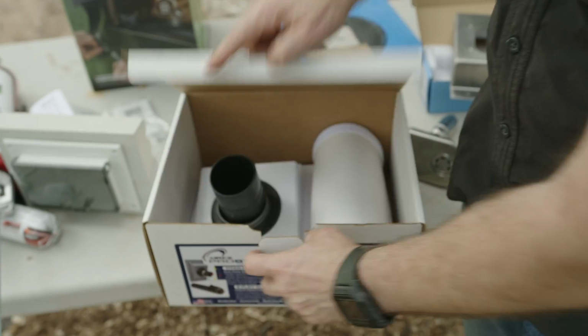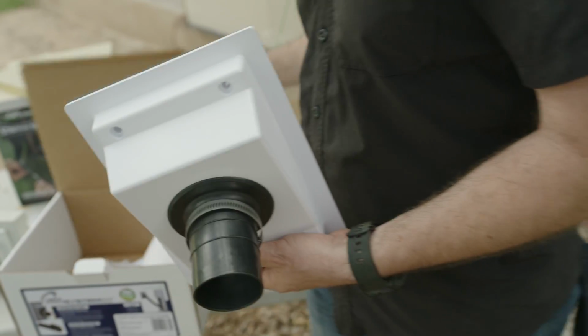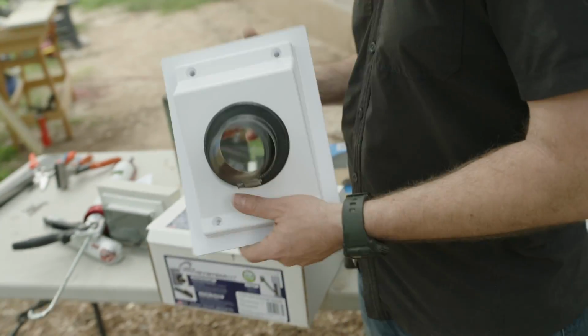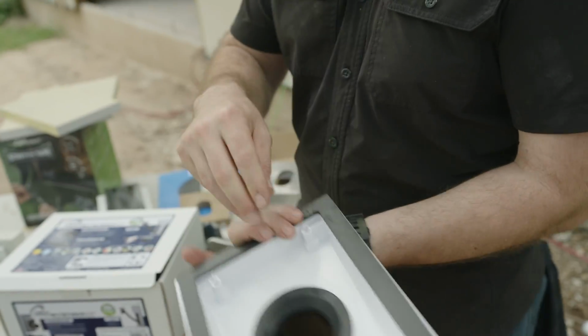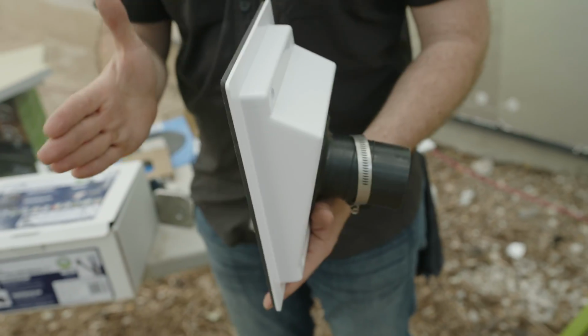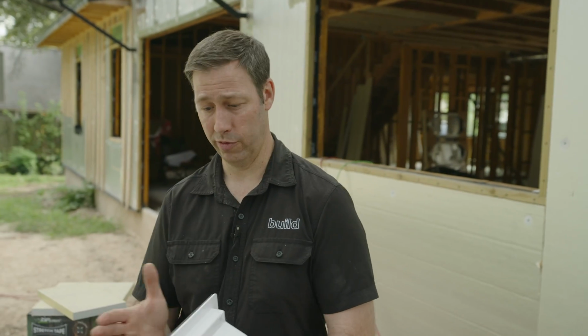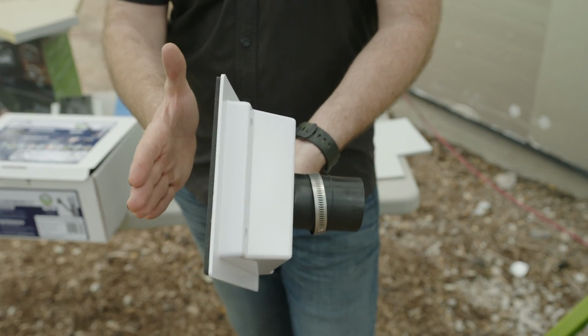And then I could liquid flash those, but check this out. I found this mounting block. This is the Titan, what's this called? AirX Pro System Kit, Titan outlet, and E-Flex guard. Now, when I bring those line sets through the wall, I can gang them and bring them through here. And remember, my ZIP System sheathing is 2 3/4 back from the face of where my Hardie mounts. So those will have a pretty good gap in there.